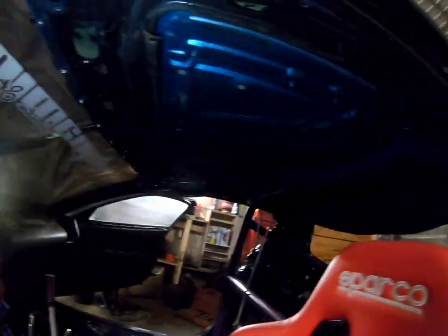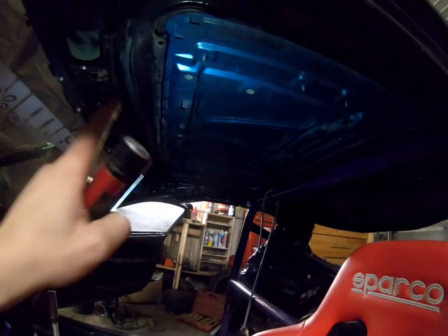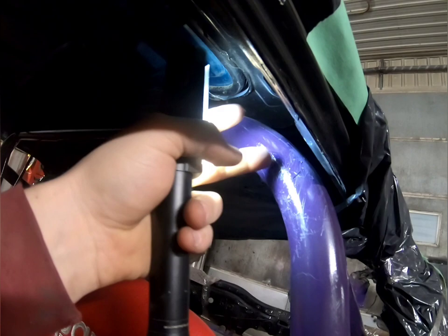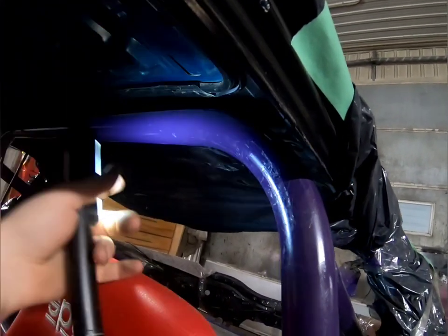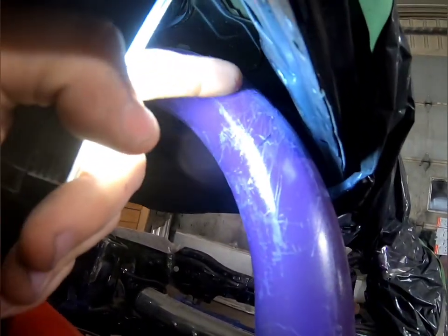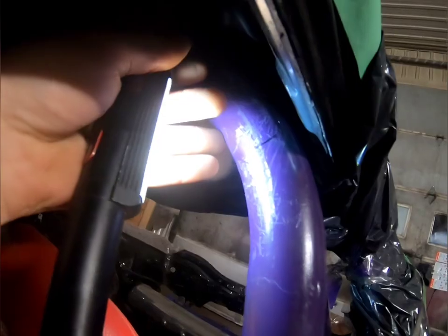To make it I need two 90-degree bends — a 90 here to go there and then a 90 back. This is usually a pain in the butt because you need the angle right, and you need to get the pitch so the mounting surface is right on each side. It also has to clear your head, so it's got to be way up in there. You have to get this angle right because the pipe is flat and it's got to mate in there.